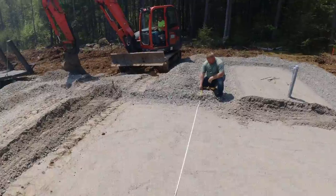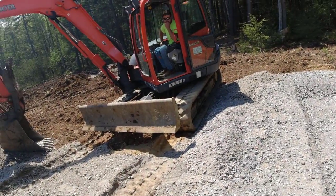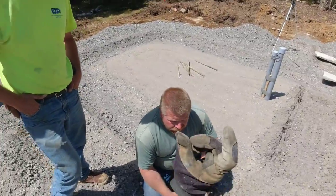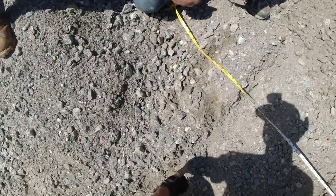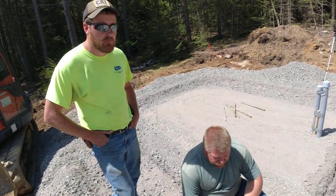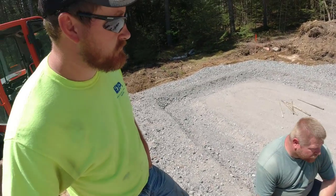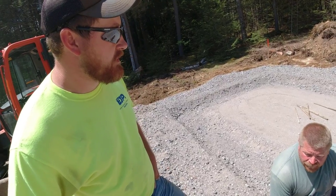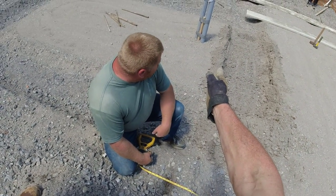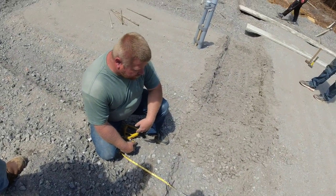The excavator actually did a really good job with the gravel he was using - getting it level and compacted. He just had never done a haunch slab like this before. We're explaining to him that this needs to be dug out deeper so we have plenty of room to use our forms, get our pins in, and use the screw gun. That's the part of the slab prep that went wrong. He was really nice about it - said no problem, he'd do whatever we needed and could dig it out right now. It didn't take him too long to get the edges re-dug to where we could get the forms in.